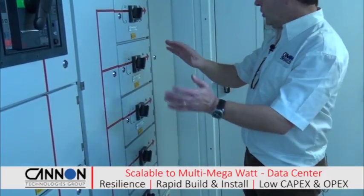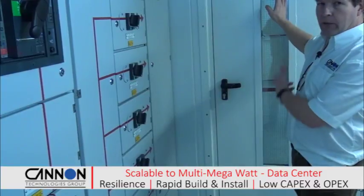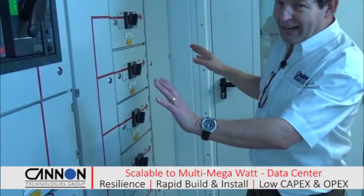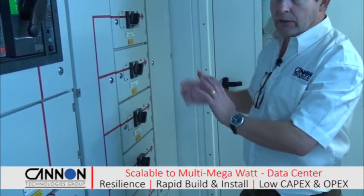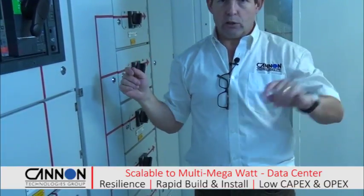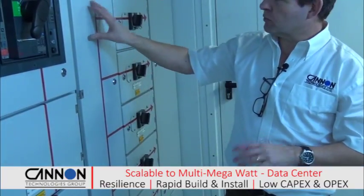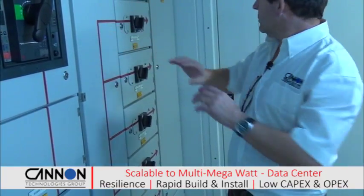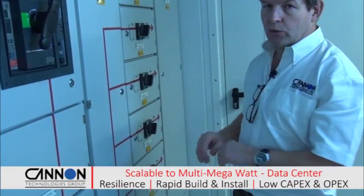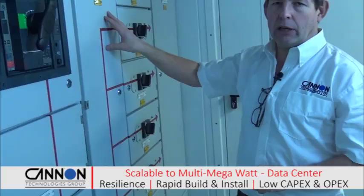and so on. All of this is power system A, and this is all repeated in power room B, which is just behind me. This is a 2N power solution or N+1, depending on how the client wants to run it. This room, and we've got the room behind us with the UPS we'll be looking at in a minute, this can support 850 kilowatts of load, which means the whole of these 2 modules can actually support 1.5 megawatts of power and critical load.